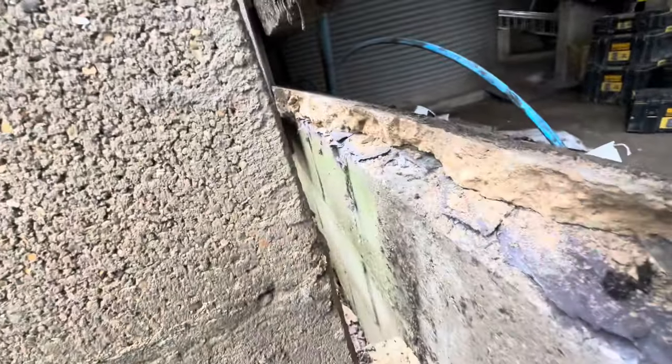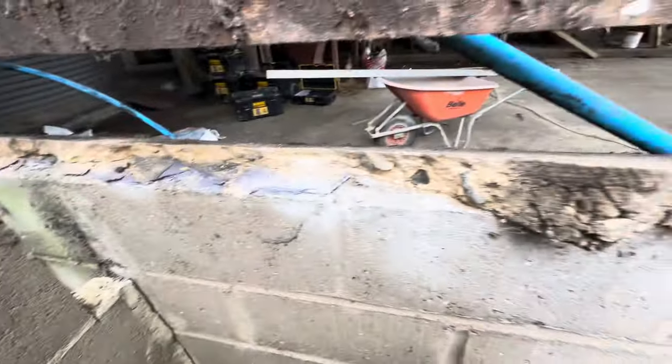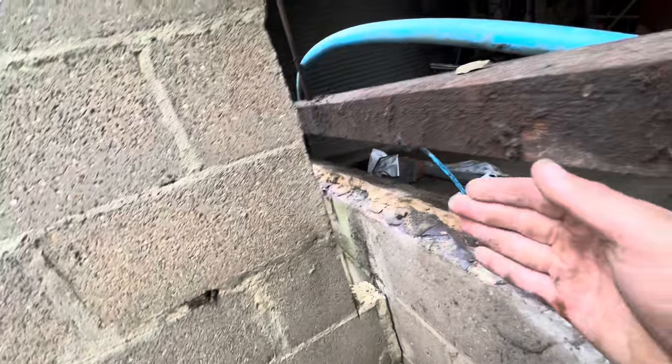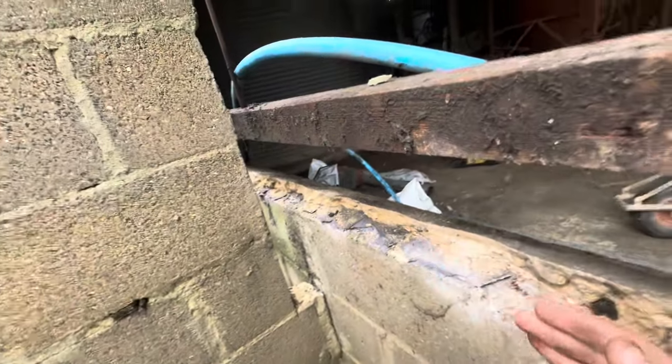So what we've got here is that this shed was added after they boarded, so they built the shed to the barn around the boards, so we couldn't get a board in behind here because the shuts were tight. We've had to knock these shuts off, take this wall down a bit to give us enough space. We've taken the shuts off to the next join, so we should be able to shimmy this board in, get it to here and then start on the shuts again.